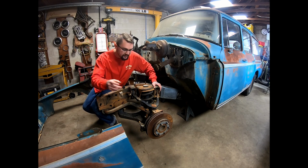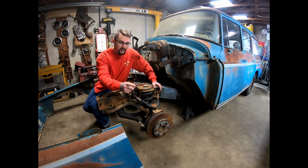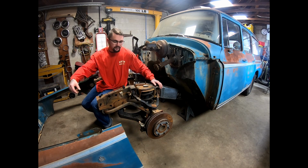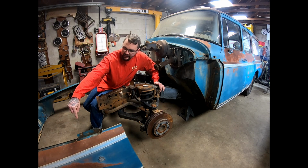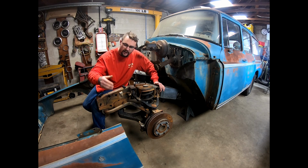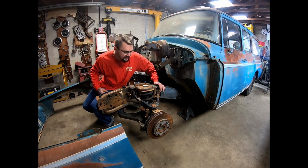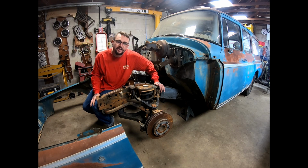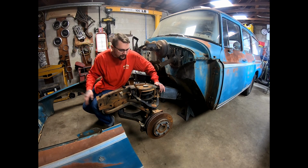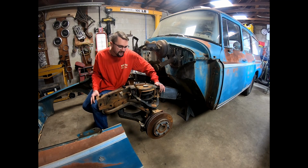So then at that point, I decided to throw some washers on here, lug nuts, and I clamped down the rotors. I took about a 2-foot piece of square tubing and I C-clamped it to this rotor where it extended out straight. I did that on both sides. I took another piece of square tubing, went across them, and I squared it up and I tacked that up. That way, these rotors on each side were held in a jig at 90, running parallel with the chassis, and we would have a consistent measurement every time because I think it was moving some, throwing me off.